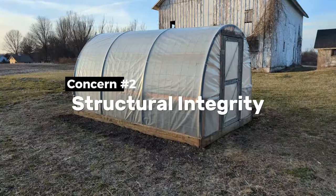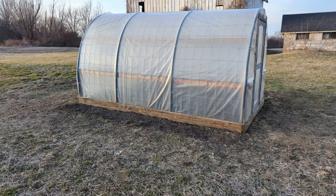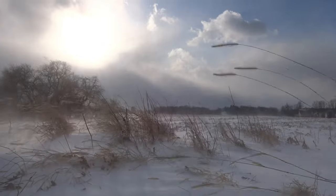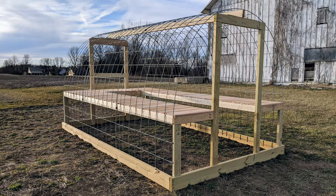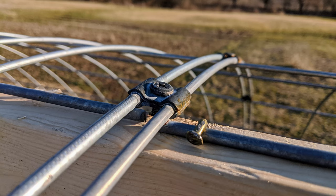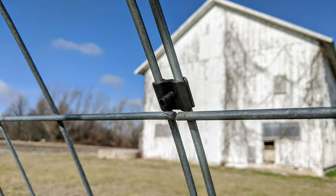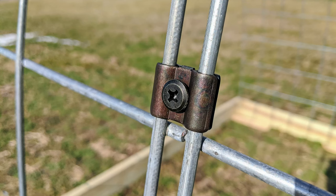The second thing I was concerned about was the structural integrity. What if it didn't blow away — would it collapse? Not only was I looking at wind load but snow load too. We get serious winds, storms, microbursts, torrential rains, and snow. In order to keep the greenhouse from collapsing I did multiple things. I connected the end wall framing of the door and windows with the lower shelf framing. I also added a ridge that helped support the cattle panels and was connected to the end framing. Then I added grid wall connectors between the cattle panels to create a structural connection between them.